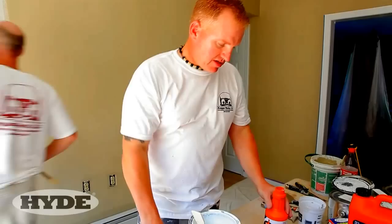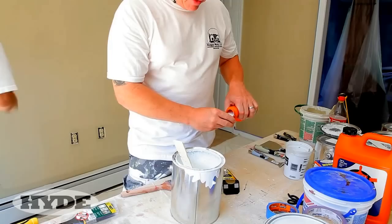So we're working large bodies of trim — actually you can't see it from here — but when we're working big sections of trim, we want to be able to keep a wet edge longer to work back into. By using the Floetrol, it gives us that advantage of being able to keep that open time, keep all that trim paint wet and work back into it.